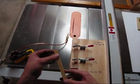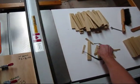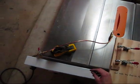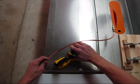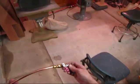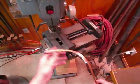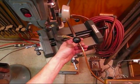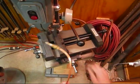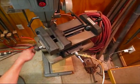So you can see it just shoots the wedge right out of the way, and that way there's no chance of that getting caught in that throat plate again. And I'll take it off of here to show you a little closer. And you can just hook this up to any airline. Like yesterday when I was doing some milling, I thought it would have been nice to have this so it keeps most of the wood chips away from all the threads and the ways and the bed and everything.